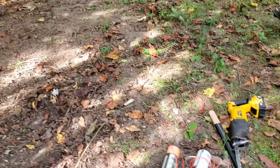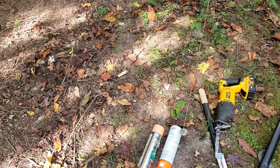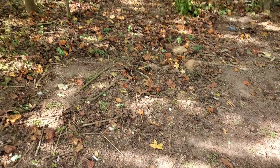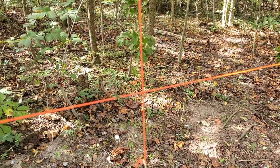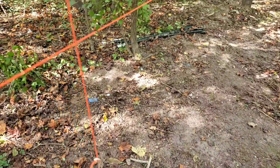And I've got this brown paint right here and this plumb bob. So you can see there's the weight, the plumb bob on there. And I can go to each one of these marks, each mark that's on there, and plumb down and mark the ground. Let's go over here where we can see it better.